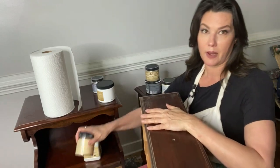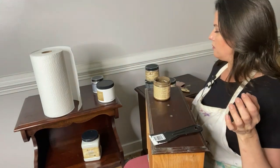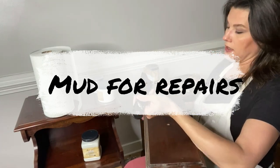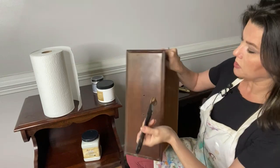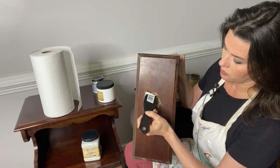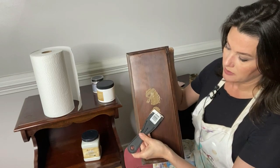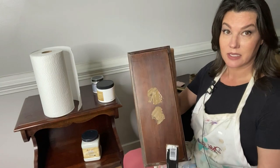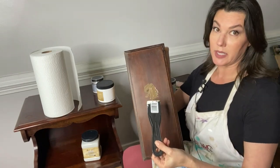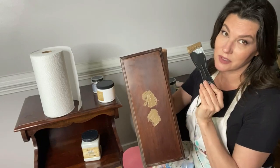You can do Slick Stick over mud or mud after Slick Stick — it really makes no difference. But we're also going to fill these holes. I have two holes from the original hardware on this drawer. I'll take my Dixie Belle mud and a little plastic spatula — or your finger, whatever you prefer — and push the mud into the holes. I like to overfill because this mud is water-based, it will dry and shrink a tiny bit. When I sand it back flat, you won't be able to see where those holes were at all. Overfill, then sand for a completely smooth finish.